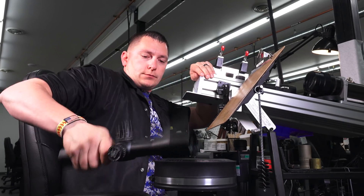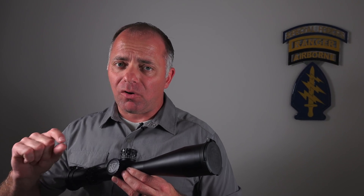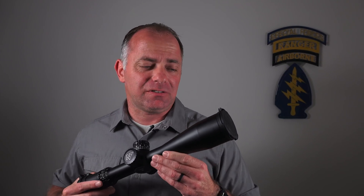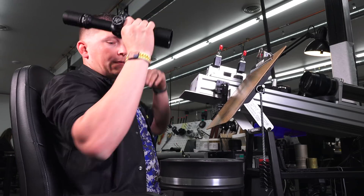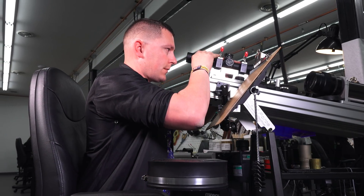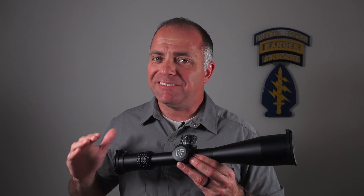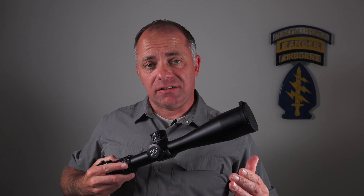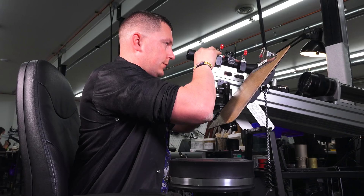The way that Nightforce checks that is kind of over the top. When the technician is doing final checks, they've got a steel block with a hard rubber pad on it. The hard rubber is there to keep from scratching the finish on this expensive scope. What he'll do is come in and crack this thing three times right on the objective lens, then throw it up on the collimator. Then he'll pull it off and start whacking on each of the four sides — three whacks on each side — and every time it goes back up on that collimator to make sure the crosshairs don't move.